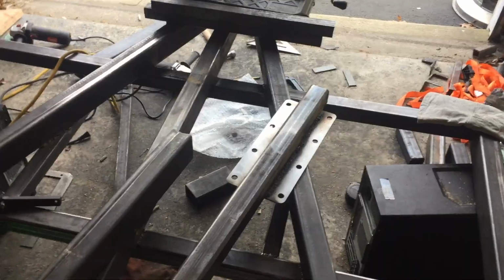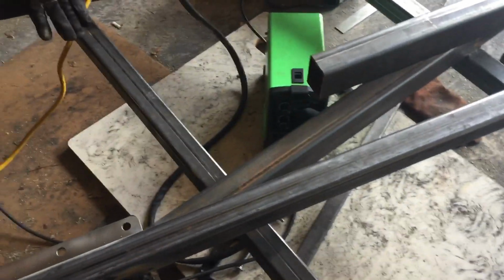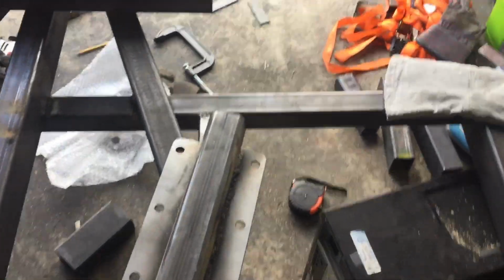Appreciate it. So I'm doing the Flexiride suspension, as you can see, and what I'm going to plan on doing is I'm making the brackets that mount to the cross member. So separate cross member, doing 2x2, 1/4 inch thick, so real thick stuff. And what I've done is measured out the side from one end to the other end with the Flexiride to give clearance for the wheels and everything else.